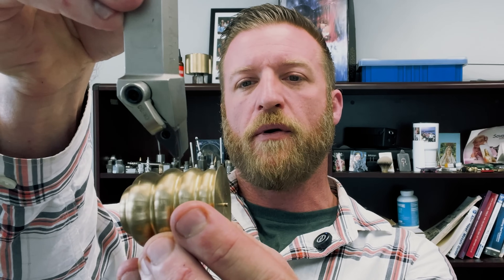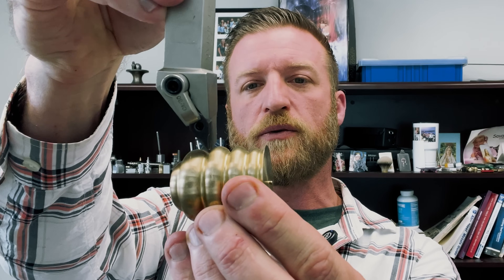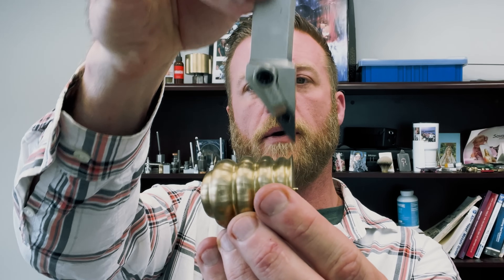A lot of people say they're going to have a rougher, pre-finish, and finish for everything. But if it's brass with wide-open tolerances, grab a used tool, program it, rock and roll. Save yourself money, time, and most importantly a headache. You would come in — rough, rough, rough, rough — and then use that same tool to profile it all. Beautiful.